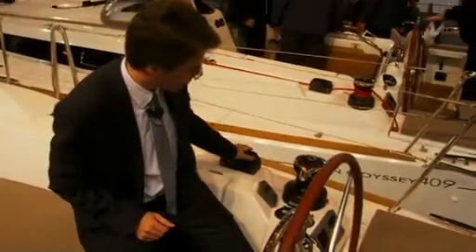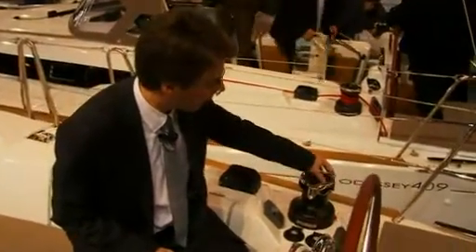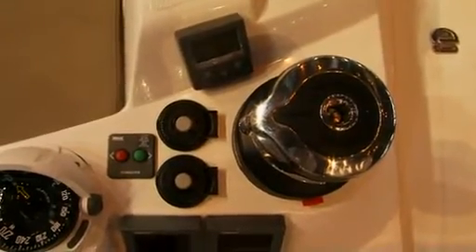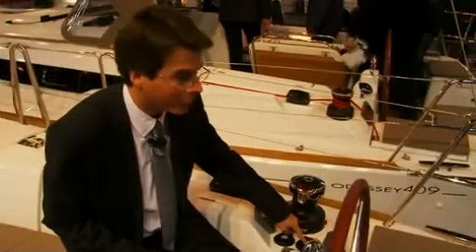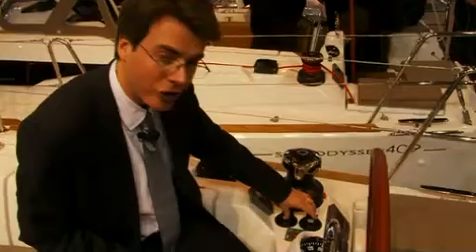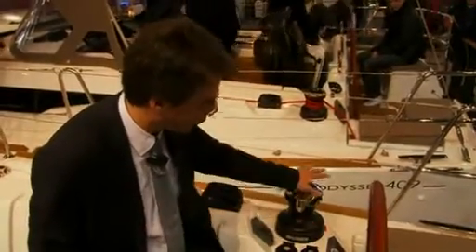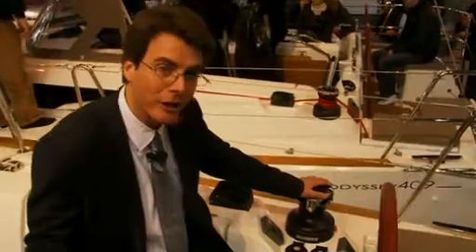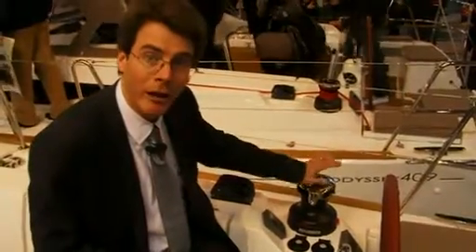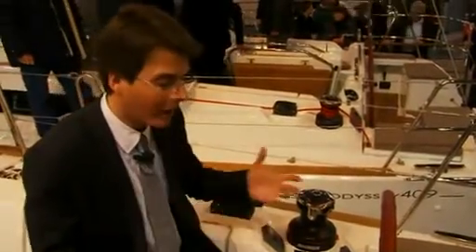This new generation of boats with the sail plan and deck plan that allows you to have all of your main sheet and jib sheets led right back to the helm — we have on this boat added the new Harken rewind winches. This system of winches has two functions: in its normal mode it runs as a high speed and low speed winch, but you can also switch over to the rewind function, which means you can sheet in and sheet out electrically. So you can sit here, put your main sheet on one winch, your jib sheet on the other, and sheet in and out electrically without touching the line at all. The self-tailer tails in both directions, and you can imagine how simple it is to sheet in and out from the helm at the touch of a button.